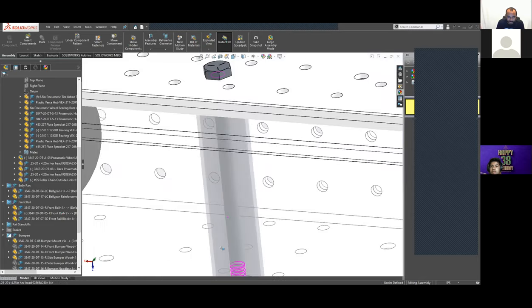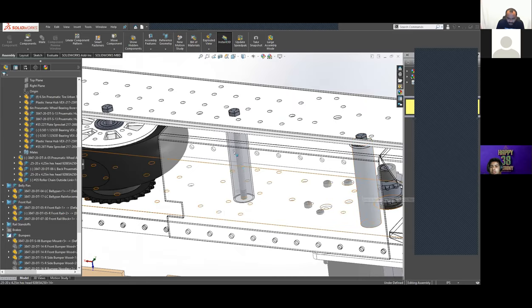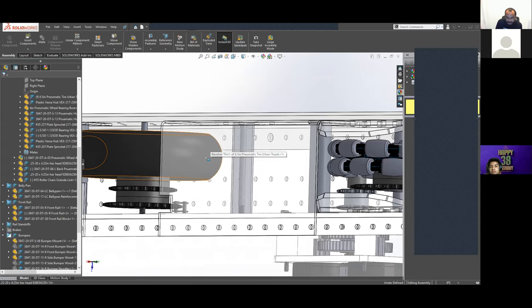So you have a 3D printed insert in here that doesn't even need to go the whole way through. It just needs to be able to locate the bolt. And as long as you can figure out how to get the bearing surface with a bolt and nut, there's a potential for localized bending if you clamp it too hard. You can start bending the sheet metal plate, but there are some ways to avoid that too, whether washers or other things. Ideally, you just make everything stiffer by having a bigger OD standoff than the 1/2-inch one that we had been using. And it ends up being cheaper for us too, because we're not using the tube axle anymore.